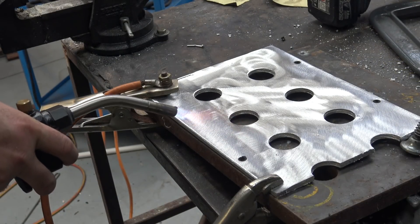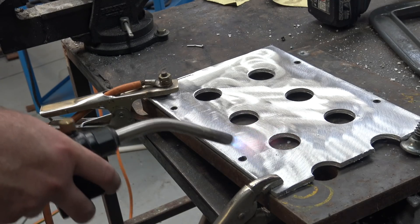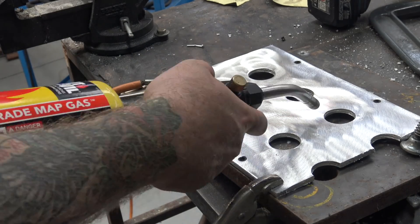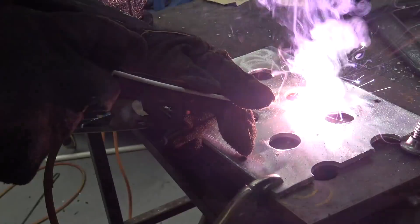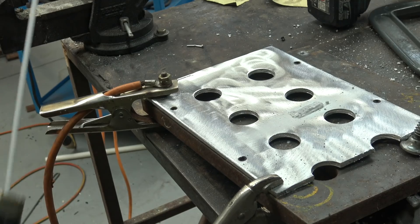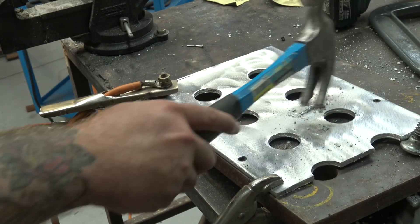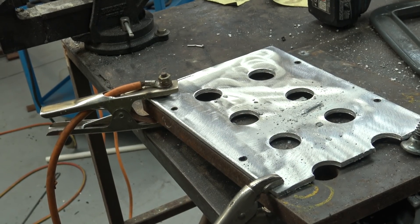I've just had my first actual run of a bead and I'm not even pretending I'm quarter proud of it, but I actually got the rod to move and burn. I had a lot of false starts — it was such a fast feed. So we've reset and re-prepped. Failing miserably, but this was not unexpected. The same as when we're doing the brazing, preheating can help, so we're going to give it a good go of a preheat. That went really well — a lot easier than before.